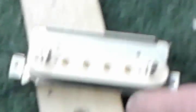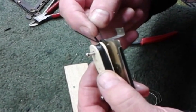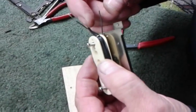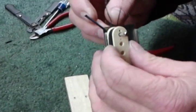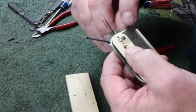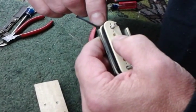Now, what I'm doing is I mounted the screw bobbin, and we need to connect the start lead, which on Build-A-Buckers and Electric City Pickups comes out the bottom hole, so there's no mistaking it. The start lead, you want to connect to ground. I had a lot of people ask me how you do that — there's many ways, and Gibson did it many ways. Sometimes they tacked it in the middle, over here on the edge, and sometimes even back where we did that solder joint to connect the vintage braid.